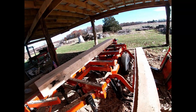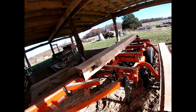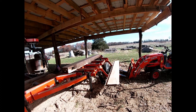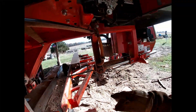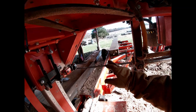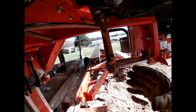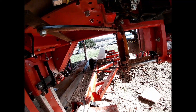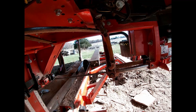We're cutting 7/8 inch board and bat red oak out of a red oak log. I'm going to show you how hot your blade should be and how to know that your coolant is working. Whether you're using water, pine-sol, windshield washer fluid, or diesel fuel - I'm using diesel fuel - how do you know that it's cooling and cleaning your blade properly?